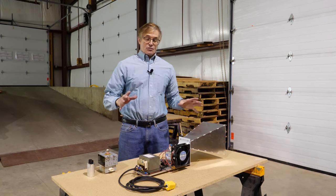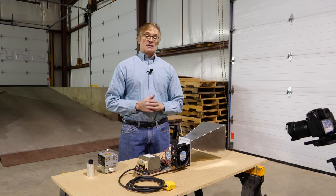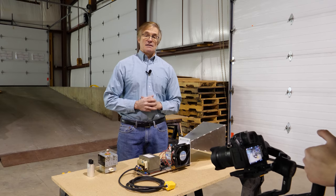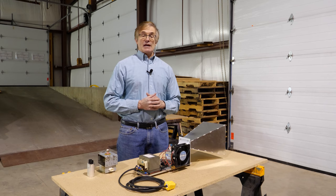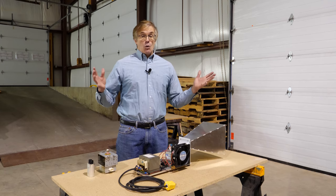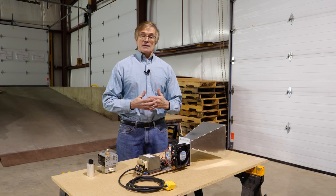Now, the first thing I was asked to address is the fact that the machine that we're using to generate the microwaves for these demonstrations is dangerous, and indeed, it is dangerous. Low-powered microwaves are not dangerous. We're surrounded, we're bathed in high-frequency radiation all the time, from cell phones to baby monitors to wireless systems. But those frequencies will not ionize your DNA. They will not cook you. However, high-powered microwaves are dangerous. I mean, that's why they make them into weapons. Duh. It's also why they have safety interlocks on microwave ovens so that you don't operate them with the door open.